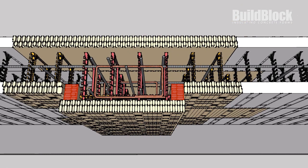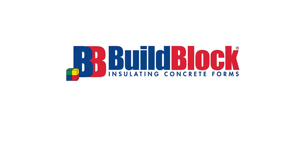When you're finished stacking, take the 2.5-inch pieces you cut from the bottom on the first course and place them at the top. Use spray foam to attach them. This is our recommended way of constructing pilasters for ICFs. Thanks for watching, and please contact us if you have any further questions.